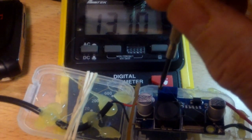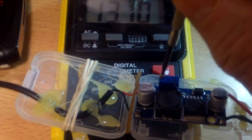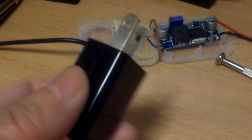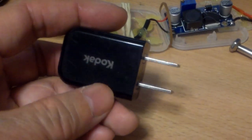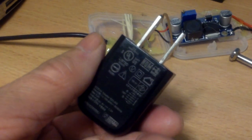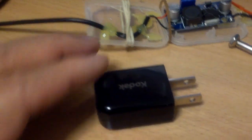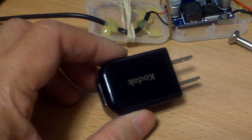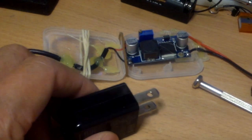For charging purposes I'm going to set it to about 13 volts. When you're using the USB as a power source to charge your 12 volt, make sure you use a quality adapter — this is usually 5 volt and gives out 1 amp. Put your hand on the adapter while it is charging and make sure it doesn't get too hot, otherwise it can catch fire and you're going to have a problem.